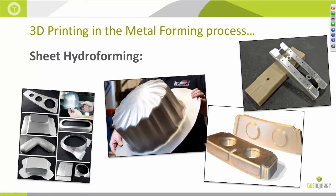Bladder forming is most used for low volume production. The sheet of metal is formed around a solid die, and very detailed parts can be produced using this method. I was brought in on an interesting application where our manufacturer was in need of flex forming a heat shield with a slight overhang on one edge. Normally that's a really difficult thing to do — as you can see in all the parts here, they have what we call a draft angle so there are no straight up and down lines, and they can all be pulled off of the die. The manufacturer determined he needed a ring created in the rough shape of the heat shield to draw the metal through it so that it wouldn't crumple before being forced into the shape of the overhang.